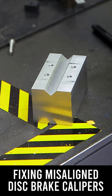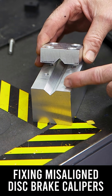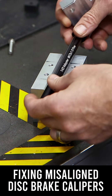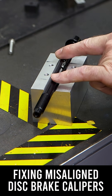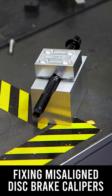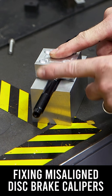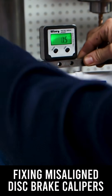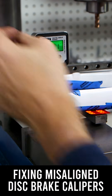To make sure I got the alignment exactly right, I made a jig. This is effectively a pair of v-blocks that bolt together. The way I'm going to hold this in the mill is I am going to put the thru axle into this and clamp it in place. That will ensure that the thru axle is square to this face. I made sure the fork was perfectly aligned with the mill using an angle finder.